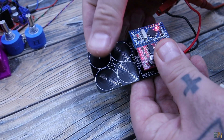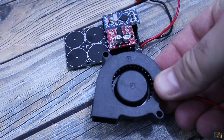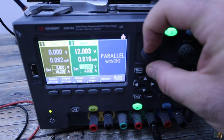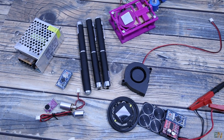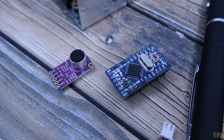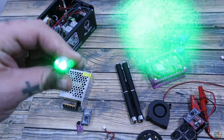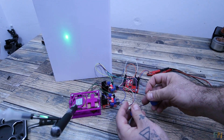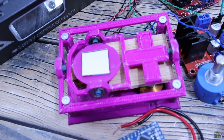I've also noticed that it gets a little bit hot and that might be a problem. In order to keep it cool, we have to use a fan and try to dissipate more heat from the PCB, maybe using heat sinks. We should also use a lower voltage, but that will also lower the magnetic force as well. Since this is still a prototype phase, I won't build the entire laser machine yet. For the next part, we will see how to analyze the sound with the Arduino and control the lasers with MOSFETs. Then we make a 3D printed case and make a homemade version of the laser show machine. We now know that we could move a small mirror faster and quite precisely without using slow, noisy, bulky and heavy stepper motors.